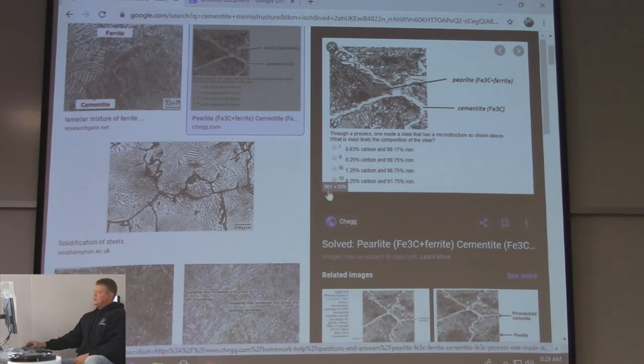Carbon content's a big deal because you've got to have a certain carbon content in order for it to harden. You don't have that carbon content, it can't harden. That's what I was saying, like with the welders. Don't cut through a weld. Well, they're welding on low carbon steel, so it doesn't have enough carbon in it to actually get hard. And the reason they say don't cut through steel or through a weld is because it's supposed to be hard and it's going to fry the blade.